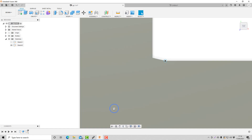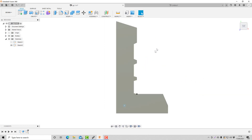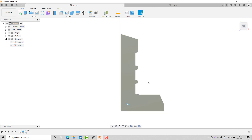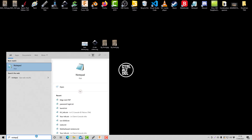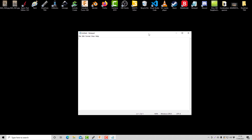And I know that from this point to this new starting point is 50mm on the X outwards, so it's plus 50mm, and then it's plus 100mm on the Y axis. Now, to get the machine from this point to this point, what I'm going to be doing is creating a piece of G-code. And to do that, I'm just going to use Notepad. So we're going to be using three commands here - very basic stuff.